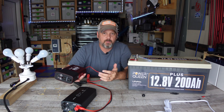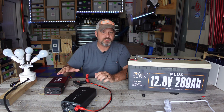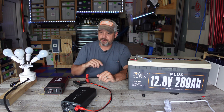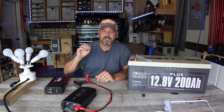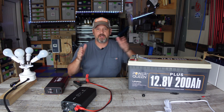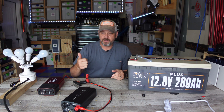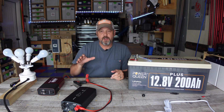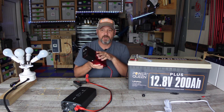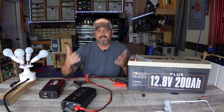Given the price, I think it's a pretty good idea to pick up one or even two of these. Find them on sale and keep them in a cabinet or garage for emergencies. I've had both units for about two months and put them through their paces reviewing batteries. I like using these because they require less power just to keep themselves running than a big 3000 watt inverter does. It's not a 100% perfect sine wave and the 1000 watt peak is iffy, but for one watt to 450 watts, these are absolutely perfect. Take care and we'll see you next time.